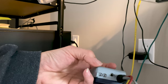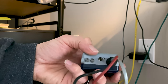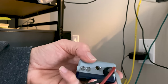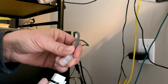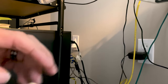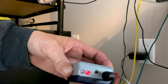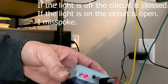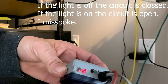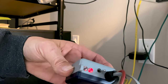Notice there's no red dot showing — I've got it set on tone mode. No red dot means it's already hooked up to the switch downstairs, because the circuit is closed. If I undo this one and plug in the other cable, the red light comes on — that tells me that circuit is open, meaning it's not yet connected anywhere. So when the light is on, the circuit is open; when it's off, the circuit is closed and already hooked up somewhere.